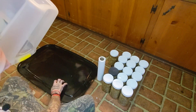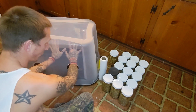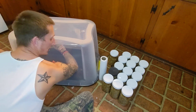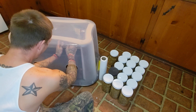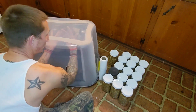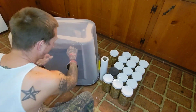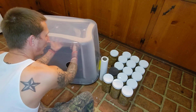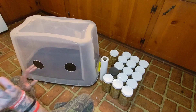Remember, you're going to have it upside down because this is your floor mat, then you set your box down over it. You want your holes to be perfect where your arms go through — not so tight it creates compression, but not so loose there's a bunch of airflow. You want the holes a nice size where you can set your arms in there and just work without sliding in and out, because that's what creates airflow and contaminants.